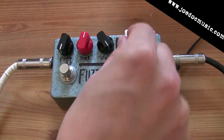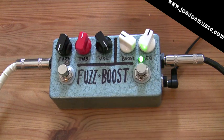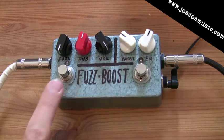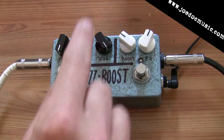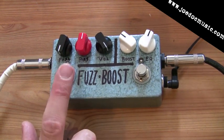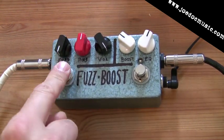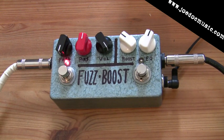Interestingly, you can actually get a gain reduction out of this, which is going to be interesting in combination with the Tonebender side. The fuzz side here is based on the Tonebender Mark II circuit, with the addition of a bias pot and the Russian germanium transistors here, which are nice and consistent but require some circuit changes. Anyway, all that technical stuff to get them working in this circuit. So let's just go straight up fuzz now, bridge pickup.